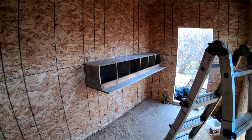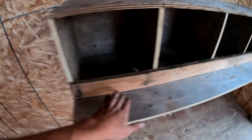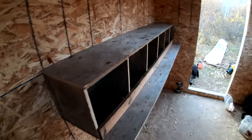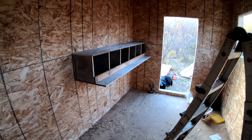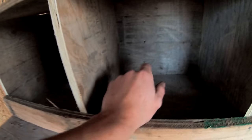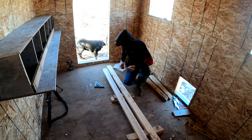Here's the finished product on our nesting boxes — nice and good and straight. I also added a three-inch strip to the front. I'm losing daylight, so it might be hard to see. I put this six-inch overhang so it's easier for the little buggers to fly up there. It might be just a tad too high — I might put a little ramp up there for them. It would take three minutes to move this if you ever wanted to. I used two-inch screws — four per stud all the way along — and nailed the corner in as well. It's really solid.